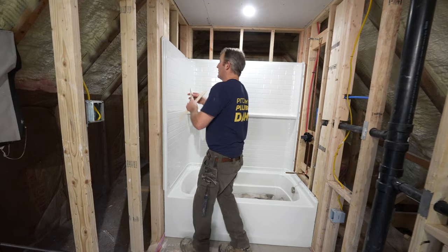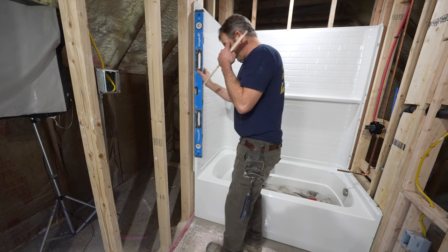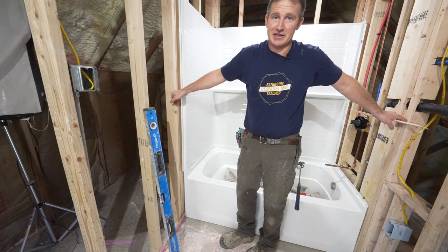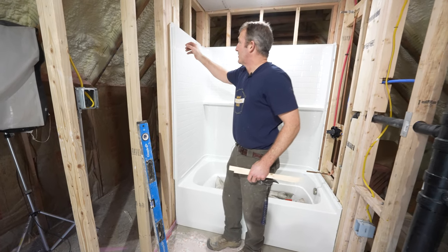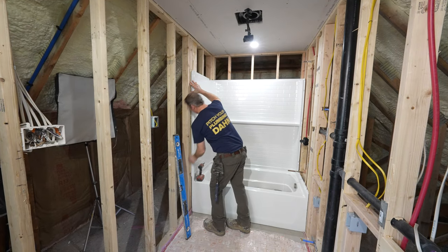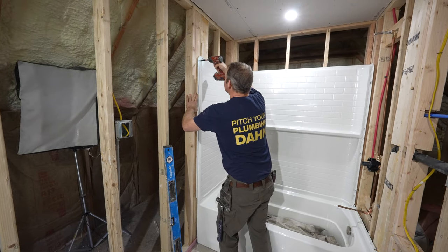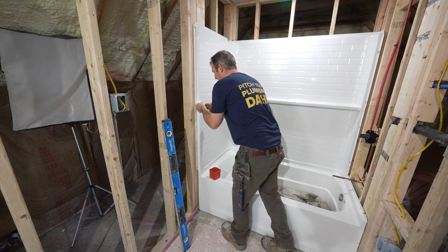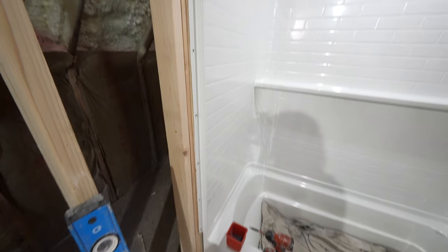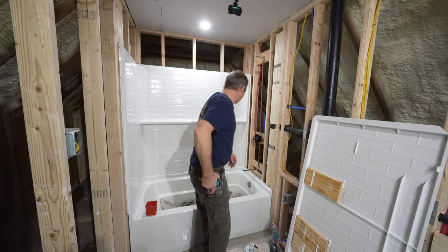You want to keep these shimmed out to make sure this is plumb. This opening was 60 and a half inches, so you are going to have to shim this out a quarter inch. It's going to be easier to put some quarter-inch plywood behind this. So that's all there is to it. Now the plumbing wall — this is the one that might be a little bit stressful. Basically you need a four-inch hole saw and another one-inch hole saw. These are important so that you have the right dimensions.